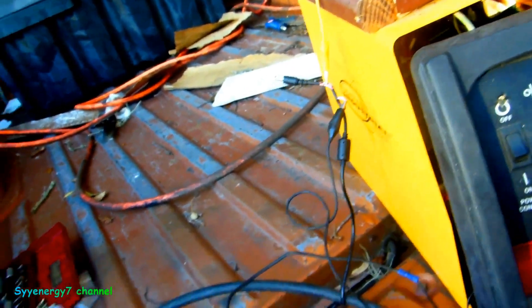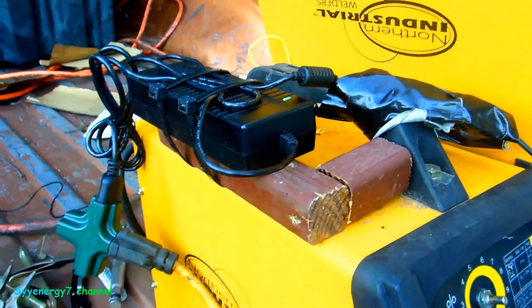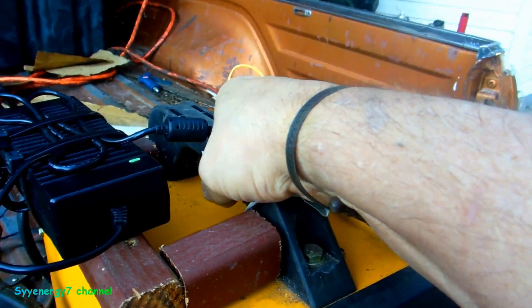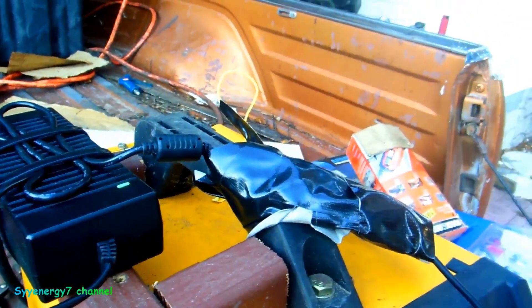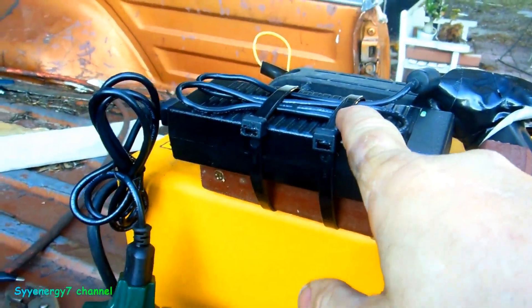I'm gonna put it together without the batteries. I'll just solder something on there, put some connectors, and leave this up here. I just plug it in and I won't need the batteries — it'll work. I got this mounted up here nice and solid, out of the way of the handle. I connected these up and put monster tape over it to hide the connections and taped it to the handle. The original connection is still intact — I stripped the wire but didn't cut it, then used the connector to tap into it. The power supply's green light is on.